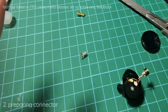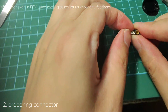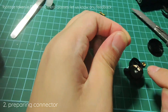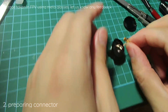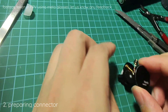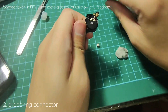So there are two ways to replace this kind of issue. The center pin is the one that is broken. The first method: you can get a donor — we don't know if the size will be the same, but we can try. We can use a donor to remove the center pin and replace it into the IEM itself. Another method is just to replace the whole connector. We get something that fits and do up the fitting with resin. So this one fits — this is not a backup plan, just another method.